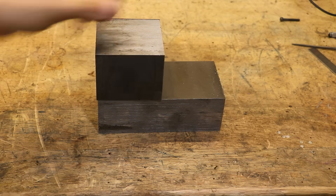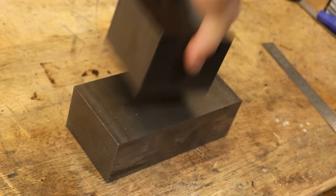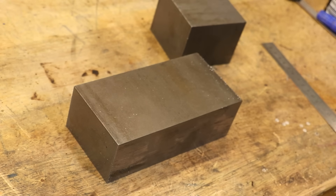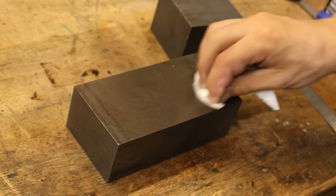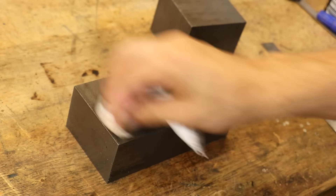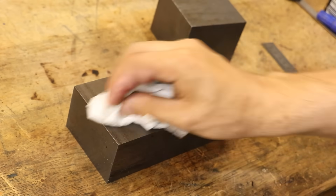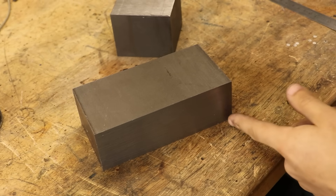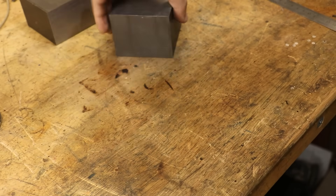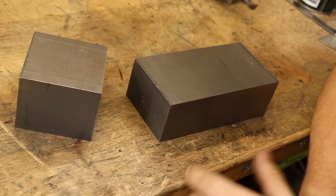First things first, let's talk about the material. I have some cold rolled steel which I picked up, and whilst it wasn't my first choice for making the cross slide, it's probably going to be okay for the tool post and compound. Cast iron would have been the way to go since it handles and dampens vibrations a bit better, but steel is going to be stiffer and stronger, plus it was the only material I could find in the correct size. The long rectangular piece will be the block for the compound and the cube will be used for the tool post.